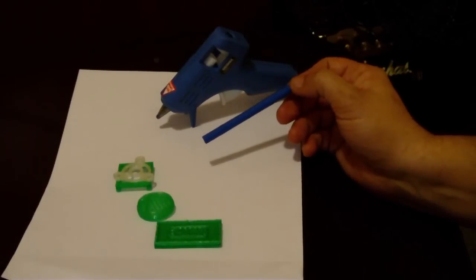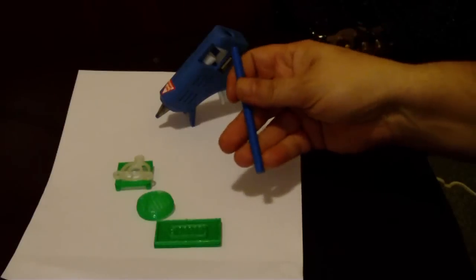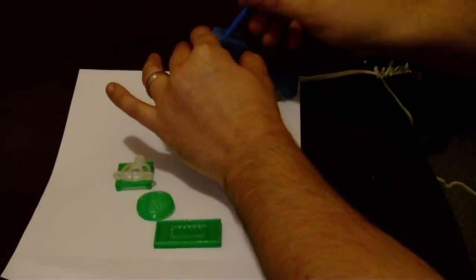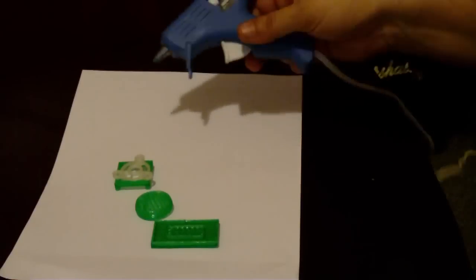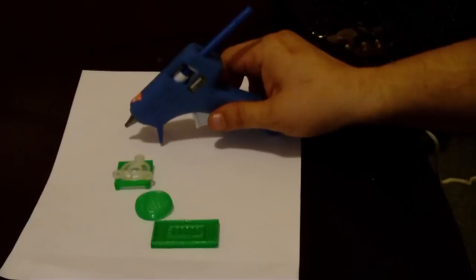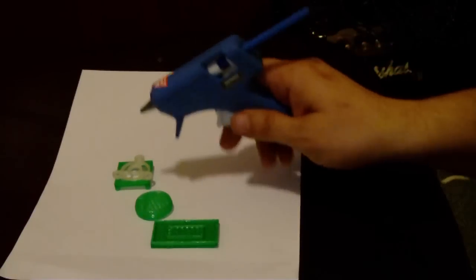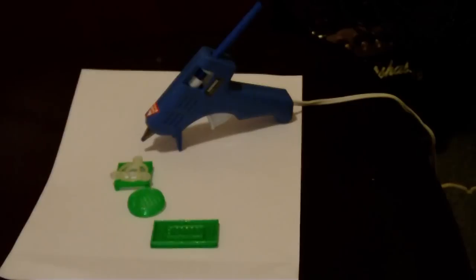It's a little harder to push than a standard glue stick because it is PLA plastic after all. But I print these little rods that are the dimensions of a glue stick, and the whole point is to be able to adhere two pieces of a print. Sometimes you'll have a model that's split in half — you have to use something to adhere the two. Right now there's crazy glue, super glue, and that's just about all you got. But my idea is to use a standard glue gun to melt a PLA stick and adhere multiple pieces of a part together.